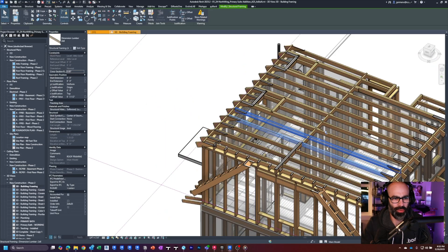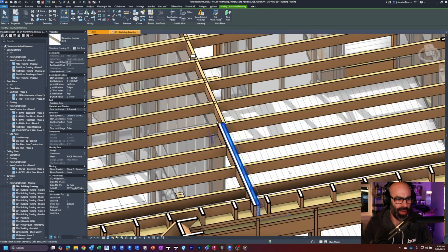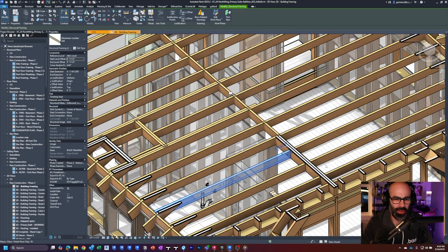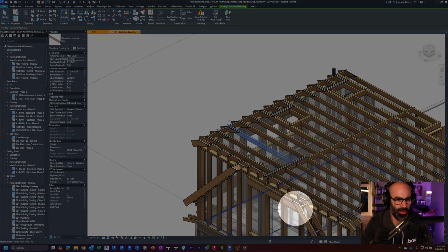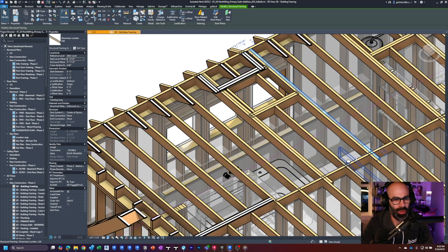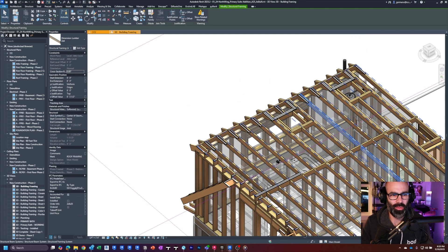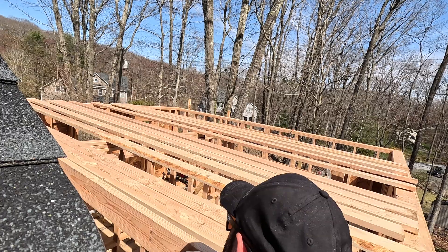You can see these are the 20-foot boards, interrupted by a two-by-ten header, which gives reason for some joist hangers. That's because the bathroom wall tucks back in a little alcove to allow more natural light into the bedroom. Because of all the interruptions, we've got some doubled two-bys running across it, which is part of the reason I wanted to keep as many two-by-six-by-20s as possible.